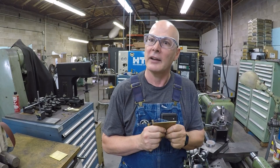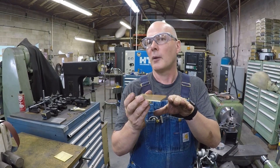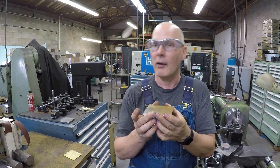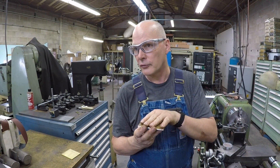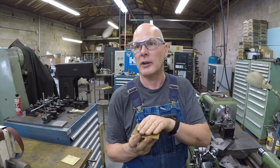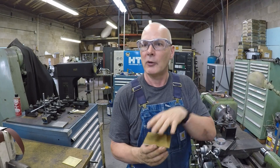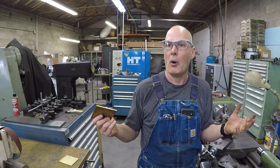Your problem is how much clamping pressure you put on any given item and how flat it is before you start clamping. If I distort this by putting clamps on it and when I release it springs back to the original shape, now it's out of tolerance. The machining process itself causes distortion — let's say it distorts five thousandths. We're going to leave ten thousandths on it from the finished size, then release the clamping to take out that distortion, so when you remachine the surfaces and release the clamps, you don't have that distortion.